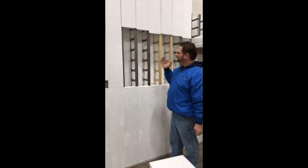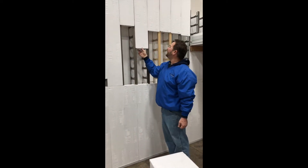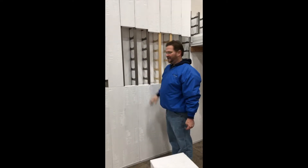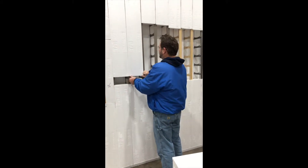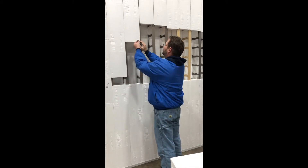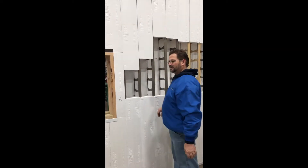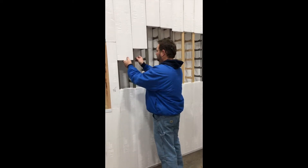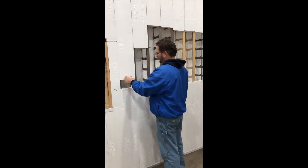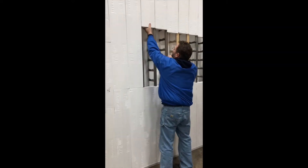The TF system is the only form system in the world where you can open up the side of the wall, slide poly panels up and down, and pour through the side of the wall. Some panels will go up stiff and there might be an area where they're a little loose — there are little holes in the side of the rails so you can stick a nail in. You can have all the poly panels up in the air, come along with a pump hose, and pump concrete inside the wall. Then somebody comes along behind you, brushes off any spilled concrete, and you slide the panels back down.